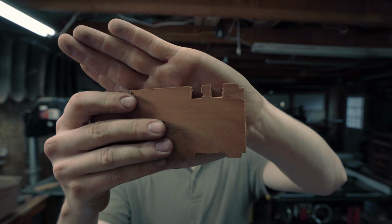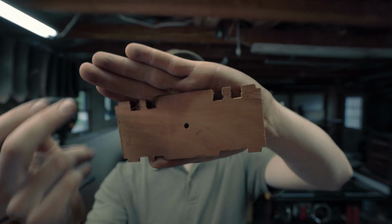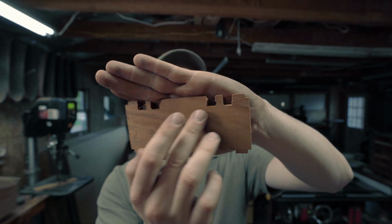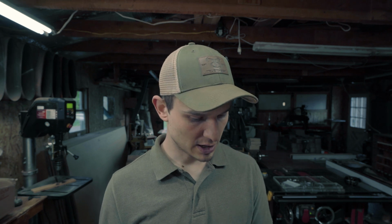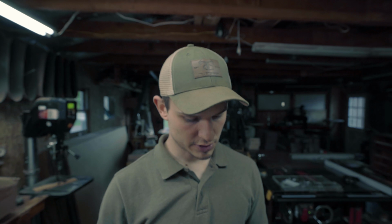a little bit big. Fusion doesn't enable us to just go in there and offset the tool smaller so that it cuts a bigger contour. You have to do that with every single tool path rather than just change your tool in the tool library. So little things like that are a little bit annoying, and you have to keep track of what's going on where in your program so that all the tool paths and all the offsets for the tools wind up working out. Every single part, we gotta watch the tolerances, make sure that they turn out good.